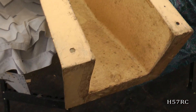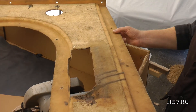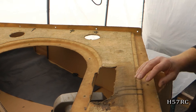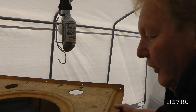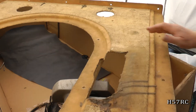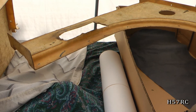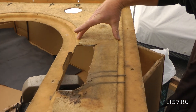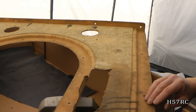What is the mold made out of? As you can see, they use a tooling gel — they take whatever part they're trying to duplicate and put a tooling gel on it. It's hard and it picks up exactly the shape, even down to the brush stroke if it was painted. This one is made out of polyester and Kevlar — it has random Kevlar on the bottom and a Kevlar mat cut to strengthen it so that you can make the part and extract it.